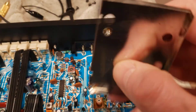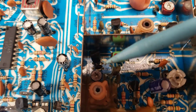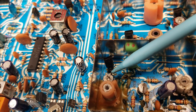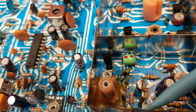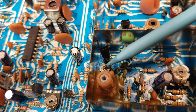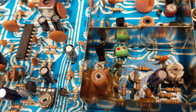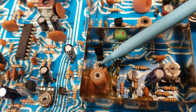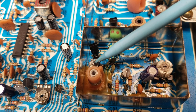After unsoldering this lid, I started poking around on things until I got to this little trimmer cap — this little blue and silver one right here, behind this coil. It's kind of all drowned in wax, melted all over the place. I started poking on that and the tuner would cut in, cut out. I got underneath there and reflowed the solder joint on it, and now the tuner is working fine. I can't make it cut in and cut out by poking at this anymore.